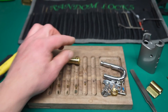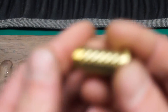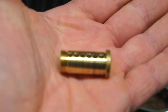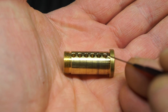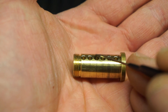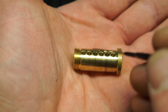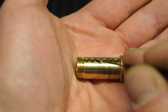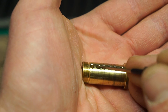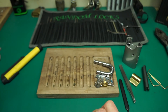Before we go — I was just about to put this back together and I noticed something crazy. Another cool feature on this lock, if it just had better pins. There we are — counter milling on every single chamber, and that is like a sheer click. It's pretty cool, there's actually a ledge. I'm surprised they did it — they did it a bit cheesy though. It's not like when I counter mill — I get right in there and make a big groove on the inside. Theirs is one diameter here and just a couple thousandths larger at the top, going all the way around. It would definitely hang up if you had sharper pins. Anyway, take care — over and out.